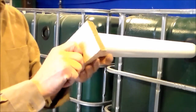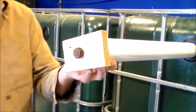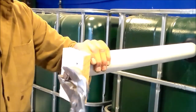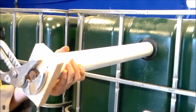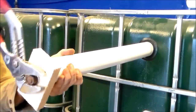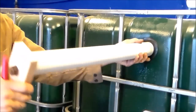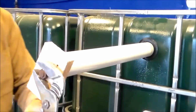After it's assembled, I snug the nut up by hand and then I'm going to use a wrench — or in this case my channel locks — and I'm going to start tightening the whole unit. As it's tightening, it's drawing the two inch pipe into the uniseal. I found what helps the two inch pipe going into the uniseal is to wiggle it, and that helps it slip into the uniseal.